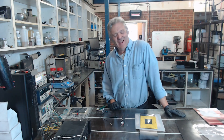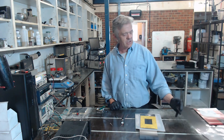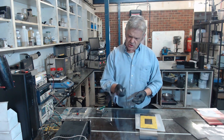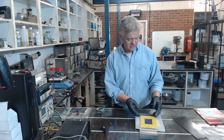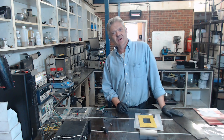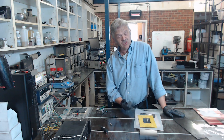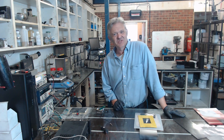I actually think it's a pretty impressive electrostatic speaker, and it's made just from our graphene-coated plastic — which you can get on our store — and this high voltage driver from eBay: 3 to 6 volts in, 40 kilovolts max out. We don't currently stock the driver but we might, as I plan to do more experimentation with high voltage and electrostatics. There are tons of improvements to be made: what kind of surfaces, what driving circuits, what materials. Plenty to do — I thought it was really interesting and I hope you did too.